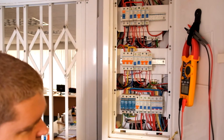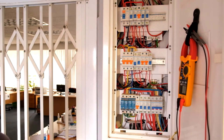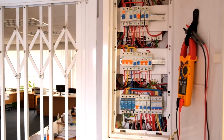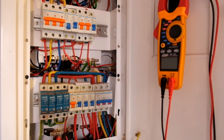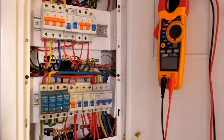So now if we wanted to verify that using the multimeter — just re-maneuvering the camera to get a bit closer — we're going to go into the neutral line and then go phase one. Red phase, 230 volts. Yellow, blue. Now we can verify that with our multimeter.